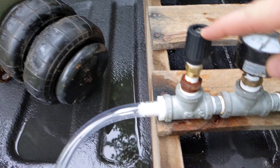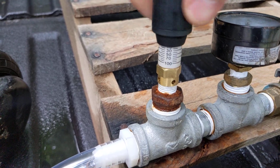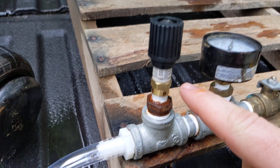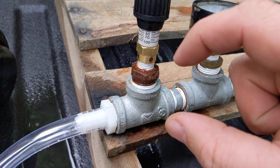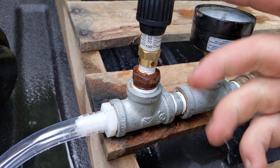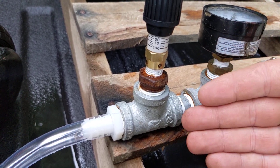I tried this — a $10 blow-off pressure relief valve, and it's adjustable. The problem is, at least at the lower pressures I was testing it, it had about a 5 PSI range where it would open at say 9 PSI and then shut at 4 PSI. So that's not really a similar setup to how ram pumps work.